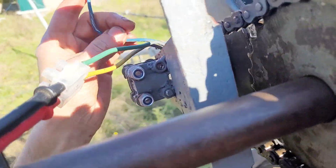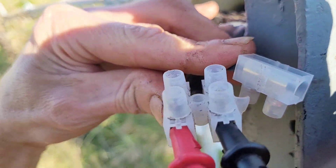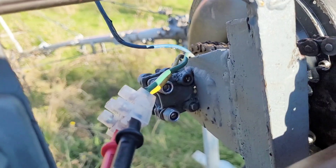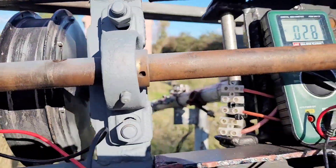But that feels really good. What I'm going to do is just swap the other wire over — the blue one. I've got those two connected to the AC multimeter and I'm just going to swap over for the other wire just to check it's producing around the same. So that's the blue and the green one now — it should read about the same.